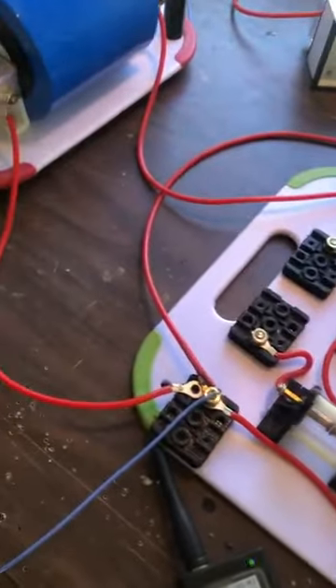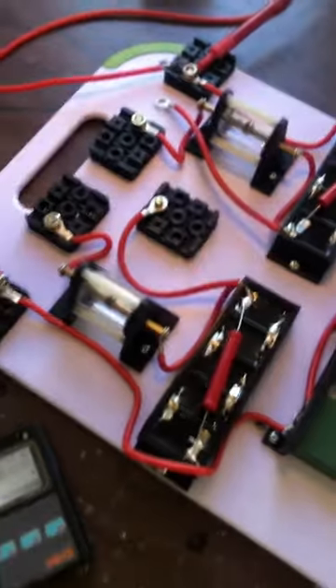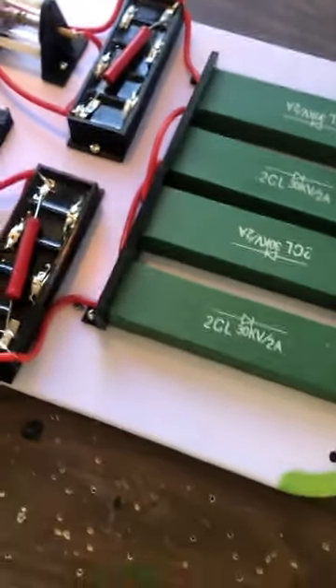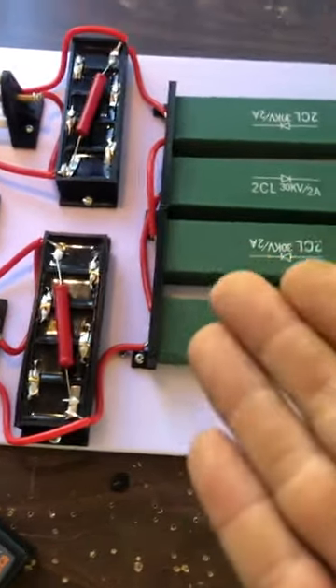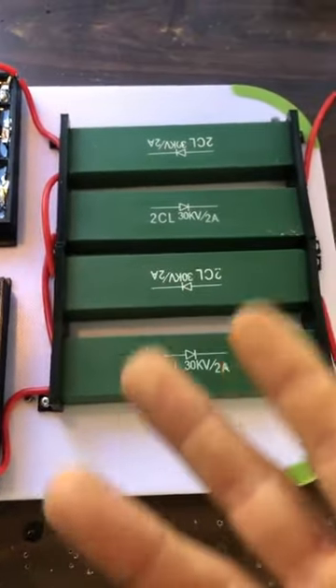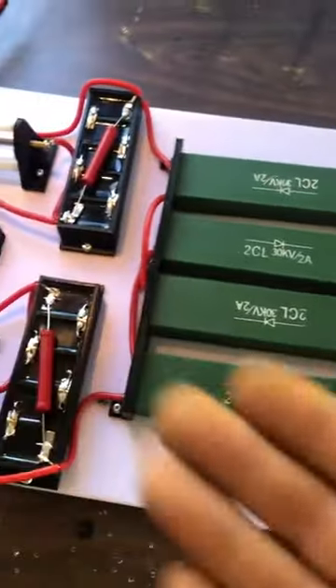This configuration — and the last configuration — any of these with the dual grounds like this are winners. I'm just taking the two high sides off those caps. Really, as simple as it gets. All this extra stuff could be taken away; maybe the caps are required, I don't know. Probably just a pair of diodes, a full wave bridge into a cap, and a voltage divider — that's the commercial device.